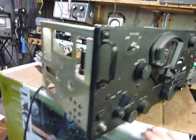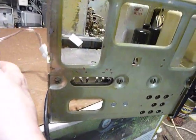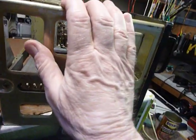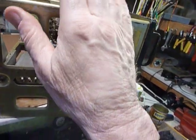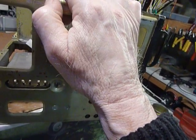The reason I got this out — I was working on the power supply because every once in a while this BC348 would hum really loud. I was thinking that sounds like a short circuit somewhere because the pilot lights went out and everything quit.